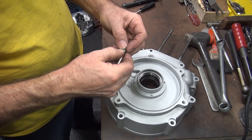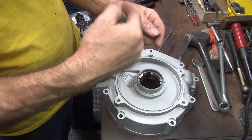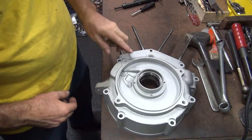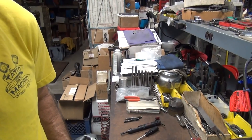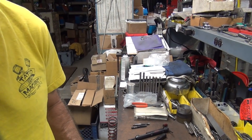And if the helicoil doesn't come out it tears up the helicoil, but when it does come out the helicoil is expanding real big so it tears up the hole you just made — it pretty much screws up everything. That's why you want to make sure you don't go all the way down. That's also why I put a bottoming tap in there to get a clean thread to the bottom. Alright, that's it for now — I'll clean this up and we'll be back.